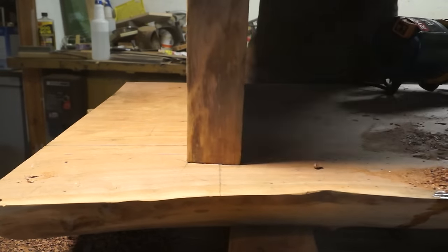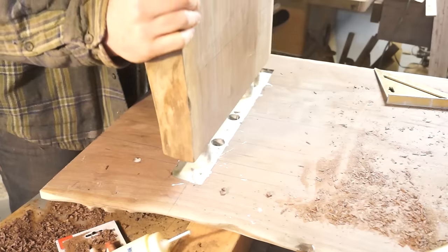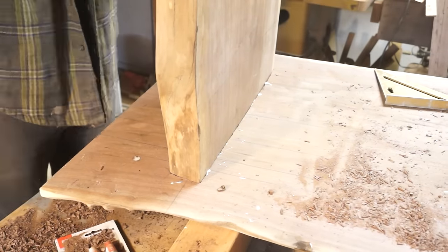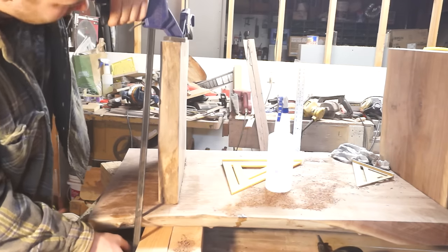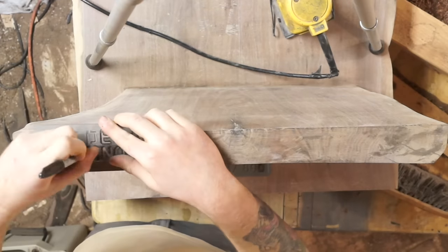Because I drilled all the holes by hand without a press, only three of the dowels fit on each of the legs, but this is plenty strong and will add plenty of support. All I had to do was square up the legs and clamp it up. Any gap I had between the leg and the recess, I filled in with walnut wedges, which made it look really tight and really clean.